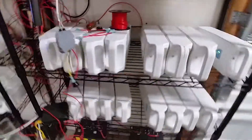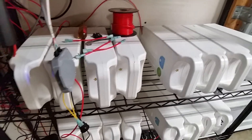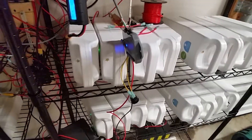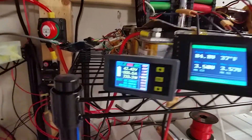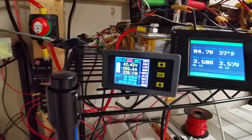Another thing I found is that to get these lights to activate — what I call the charging light — you need to have almost 3 amps of current, and you have to have the right voltage. This morning we had a little bit of sun and I was pulling about 15 amps, and they actually kicked in.